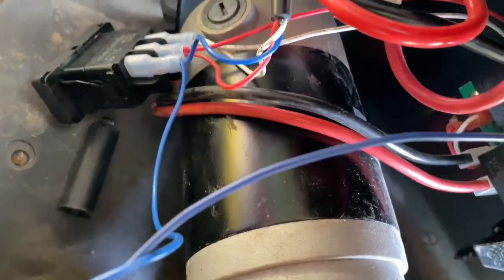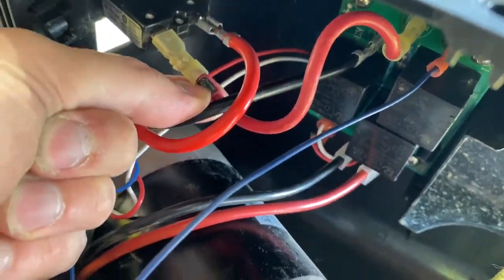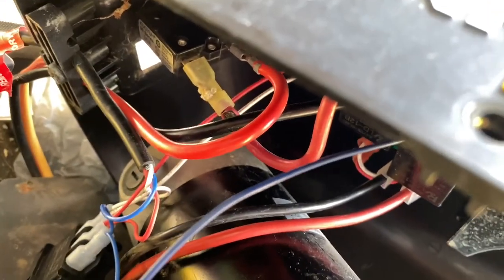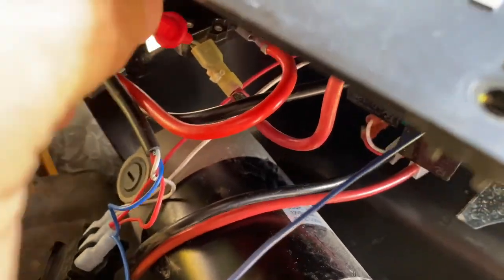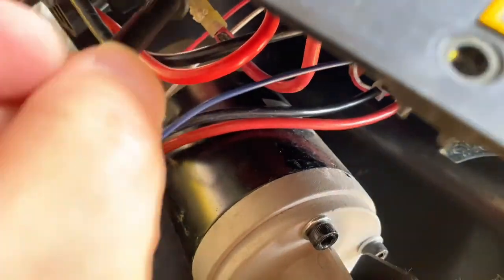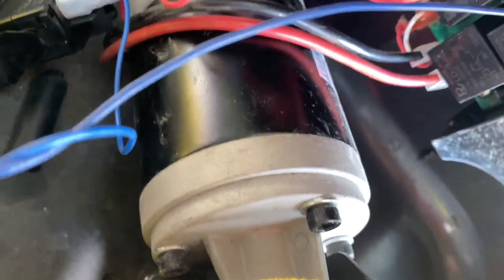Now we just have to see what's going on. There's a little burnt spot here — it looks like there's a circuit breaker, and it is. I can take and make sure the circuit breaker is still good. It would show zero ohms if it's good, or OOL — overload — if it's bad. And that shows that it's good. I'm going to take a measurement from here to here on the board and make sure that's good.